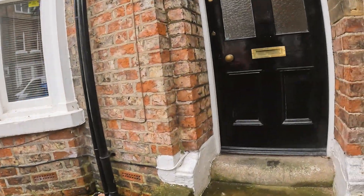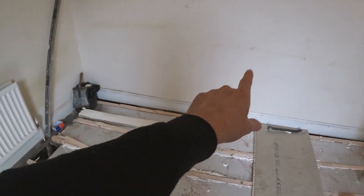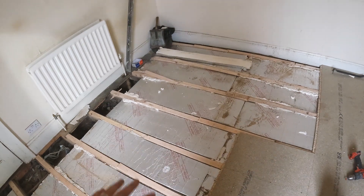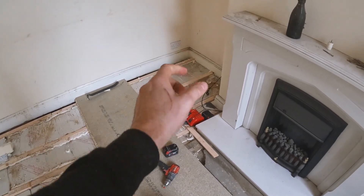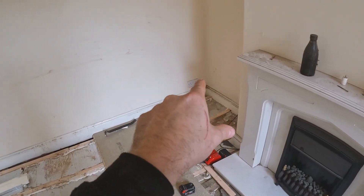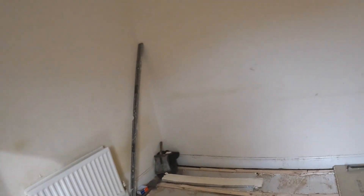So this is the job we're doing - we've got loads of little bits around this house. This builder we've started working with just wanted a few bits done. We've got a few replacements: socket replacement, socket replacement, socket replacement, socket replacement. Then we've got a USB socket in the middle going in, a USB socket at the end, and this is going to be a little office. The sockets are wired from the fuse board as a ring. We're going to chop into that ring, send one cable to this point and that point, and back to extend the ring.